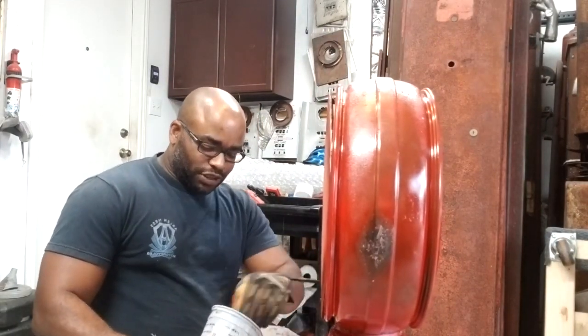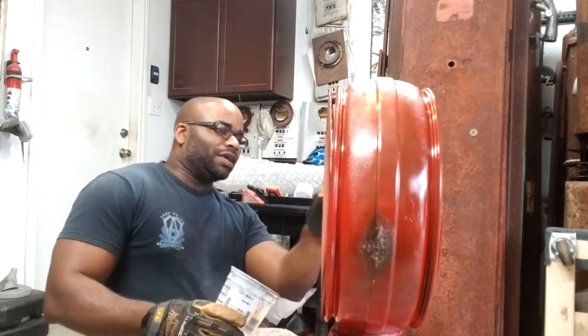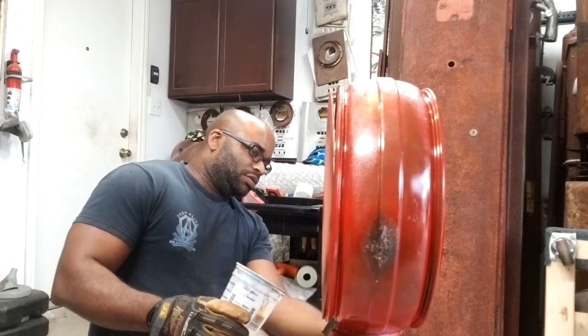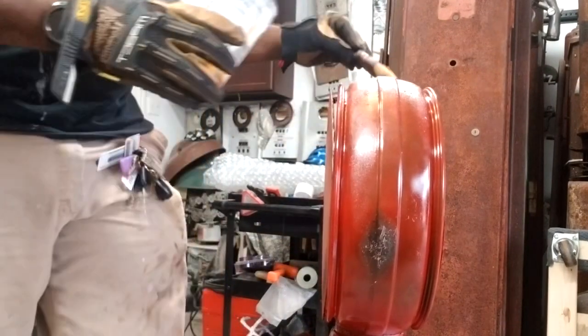Now, I've also done this where I'll put on the aircraft paint remover and let it sit, and then I'll ignite it and knock it out with water. So, it all depends on how it's looking and how I want it to look overall.